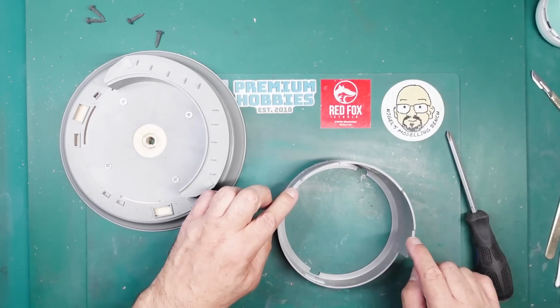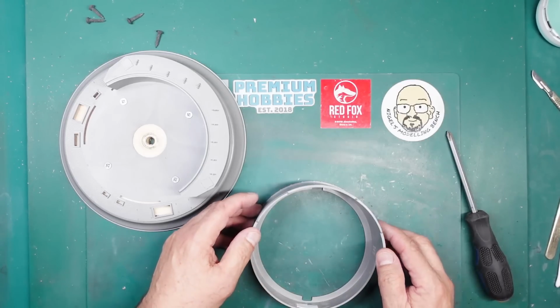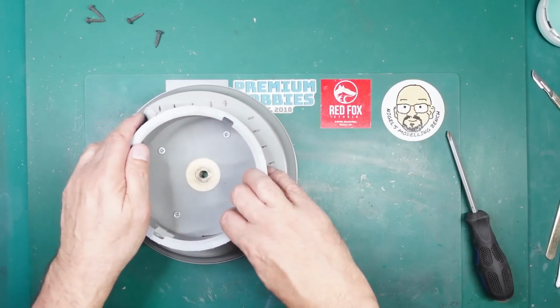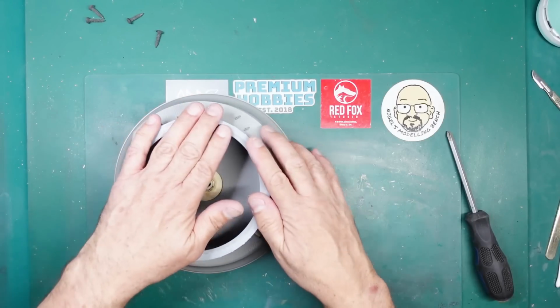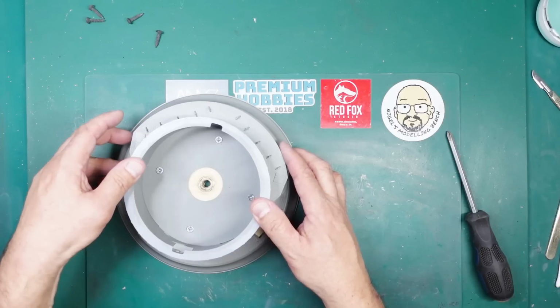You see this isn't flat. That's not flat either. So that's actually needing to be pulled down where it's not flat, so we're going to actually make that even worse. So we're going to have to basically get this down, get it all clamped in place, and then get this sanded flat. Otherwise when we put the turret on, we'll have a gap around the turret.